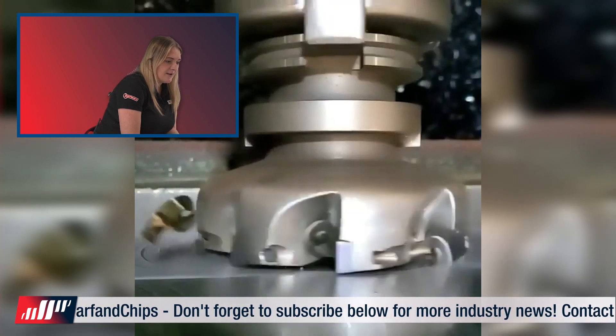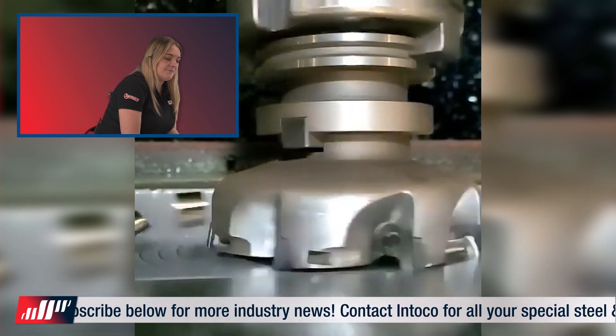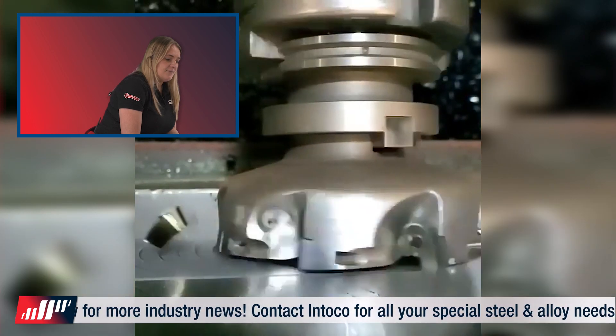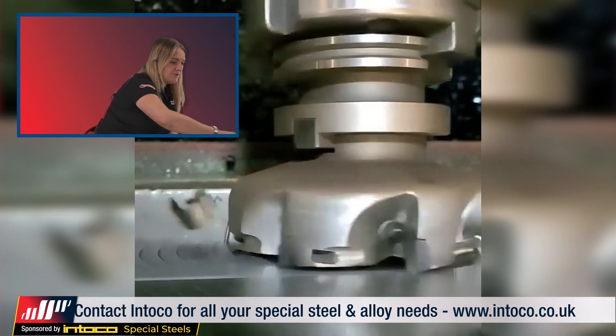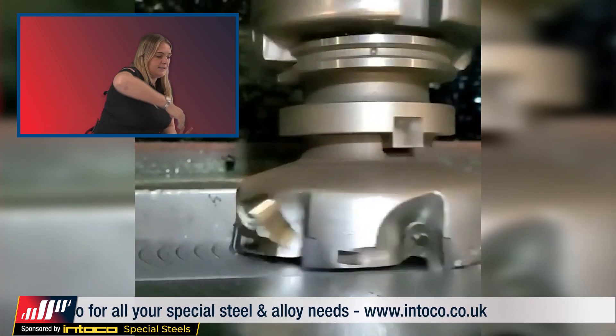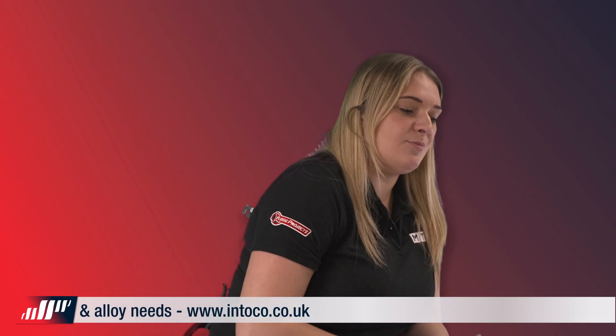It's very quick. Do you know what machine it's on? I just thought it was nice because it shows exactly what happens — what a finish. And look, as you can see on the left, you can see the trail that the face mill is leaving behind. A tip: if you want to have a smooth finish, take some of the inserts out.